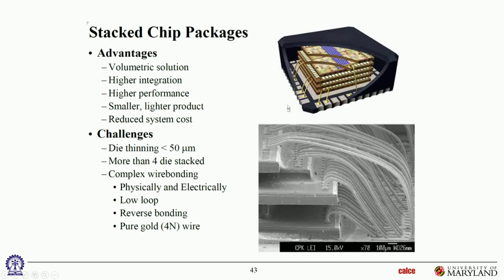And again, you can see more and more examples of different kinds of die stacking, different sizes, with spacers, without spacers, crossed dies, all of them together over here. So it gets to be quite a mess of wire bonds at the end of the day, but it's doable, and people are actually doing them.